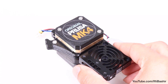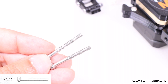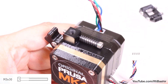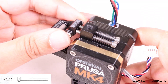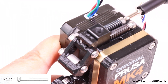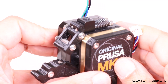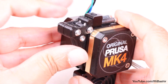Place this to one side for the moment, but for now we turn our attention back to the extruder assembly, specifically the top end. We'll need two M3 by 30 screws next, so with those to hand, drop on a 15 by 5 spring onto each screw, before pushing both screws through the protrusion on the heatsink just above the motor. There are no threads inside here, so the screws should go straight through and screw directly into the idler swivel assembly we just prepared. Take care to install in the orientation shown here, and stop tightening as soon as the screw tips reach the front face of the idler nut. Take a moment to double check the screw tips are flush and that the orientation is correct, with the two dots visible up top. If all is okay, you should now be able to close the idler door and lock it with a reassuring click.